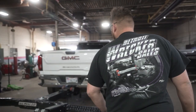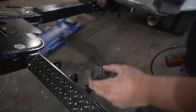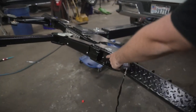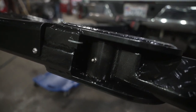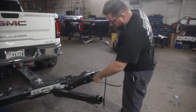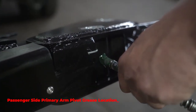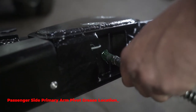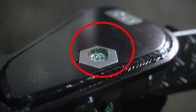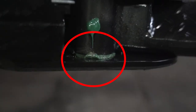Take your controller and close these arms a little bit so I can access this grease fitting right there. Get that on there and you'll actually see the grease coming out of the bottom and the top, so we know we got all the grease in the pin and it's coming out the bottom of the bushing.